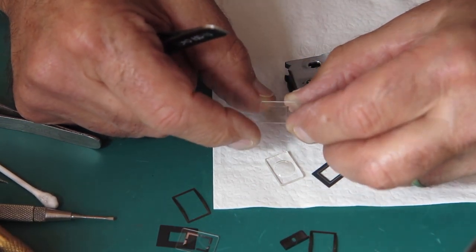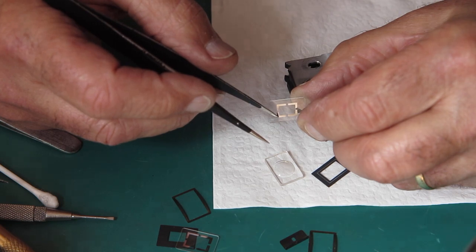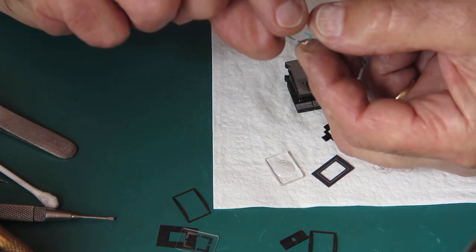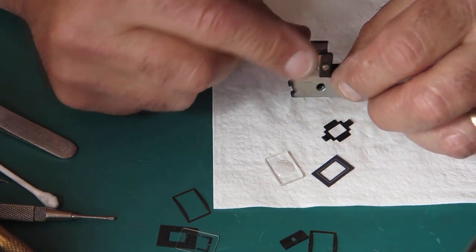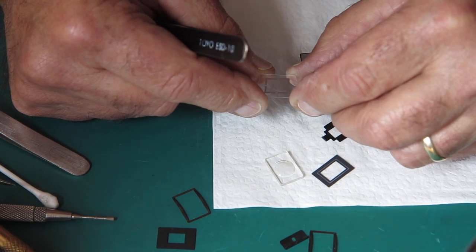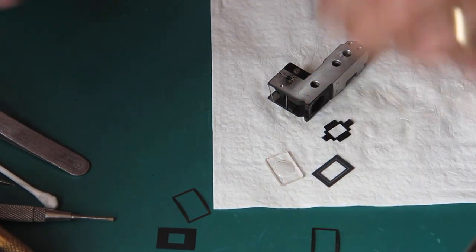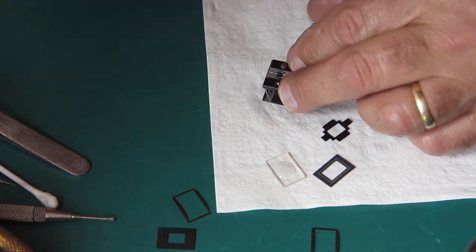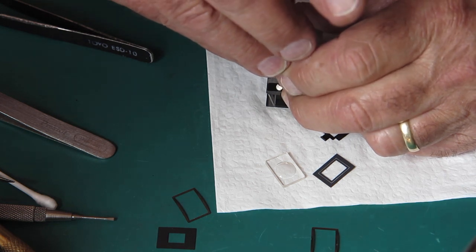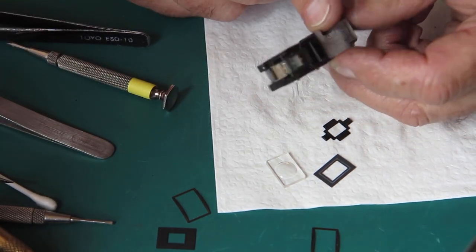If you touch the semi-silvered surface you will not like the result — you'll end up with a nice clear piece of glass and you'll have no rangefinder image. This is quite clean and doesn't really require a lot of work. I'm going to clean it in the ultrasonic cleaner at the same time as the pieces of glass with the frame lines on. I'm making sure I've got this in the right way — the silver edges should be facing to the rear, and the piece from the middle section, the silver line should be facing to the front. If you get them in the wrong way you will not get proper bright lines showing in your finder.